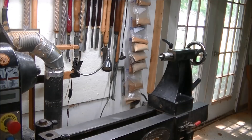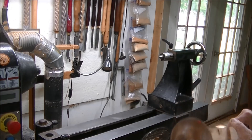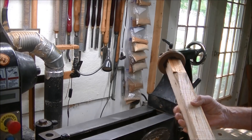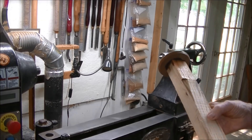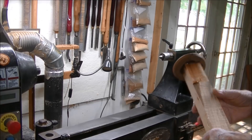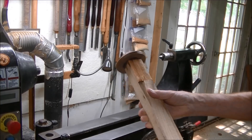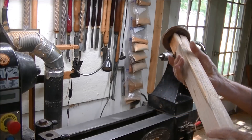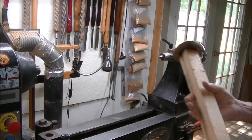I got this other one out of the clamps. I didn't have enough pallet wood — I had a couple pallets but they're covered up and I'm too lazy to move everything. It turned out to be one and three quarter by one and three quarter, which is fine for the handle, but I like to put a knob right here and I like my handles one and a half inches across because I've got big hands. So I found a piece of walnut scrap with a sprue in the center and some epoxy. I'll let that sit up and make my knob out of epoxy.